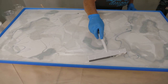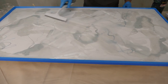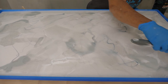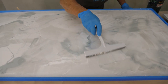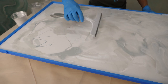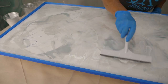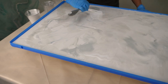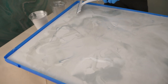Take my spreader — now I'm going to drag and create the marble. I'm not pushing my squeegee all the way down to the bottom. I'm just basically letting the weight of the squeegee drag along the top of the surface. I'm going different directions — don't get in a pattern where you're going all one direction. Long strokes, all different directions — that just creates the most natural looking marble.